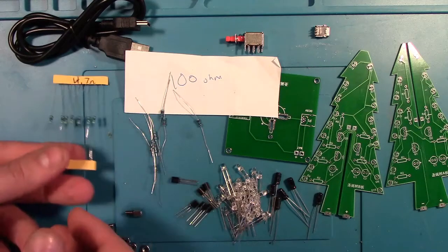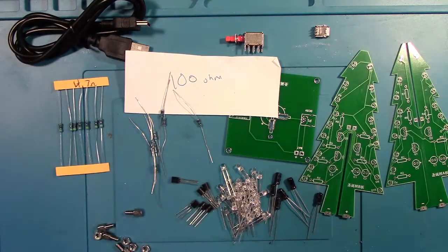Now, when you plug that in, if you were to look this up, it says 4.1, although they say 4.7. I plugged it in the resistor calculator, and it says it's actually 4.7. I have a good resistor calculator site that's actually on DigiKey, so I'll put that in the link notes, and it'll help you identify these. Just makes it easier, in my opinion.